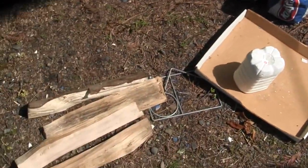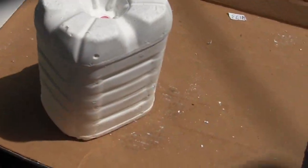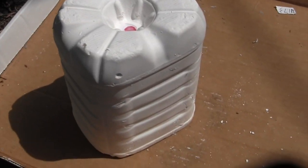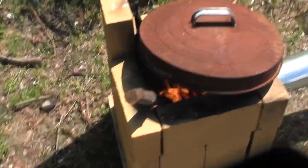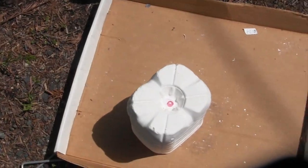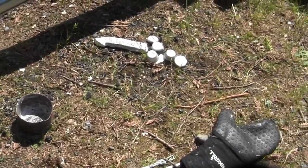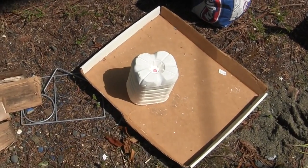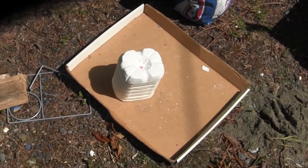Welcome back, it's been a while guys, sorry about that. Today we're using this plaster mold I made with the grappling hook print inside of it, and we're going to try and pour some molten aluminum in here. We're first going to flip it over, put it in the foundry so all the plastic can melt out, and once that's done we're going to melt down some aluminum and pour it in. Hopefully it'll work — I'm not expecting it to since it's my first time with plaster, but hopefully it does.